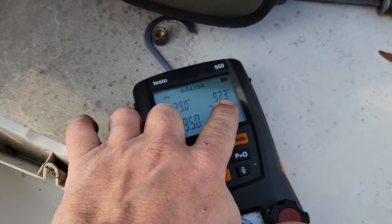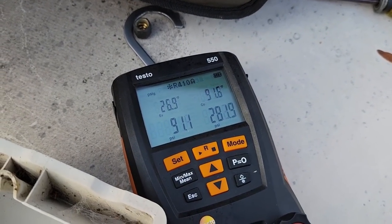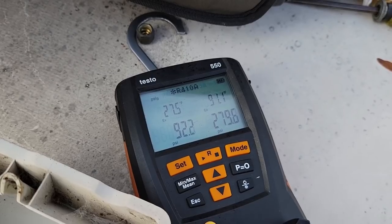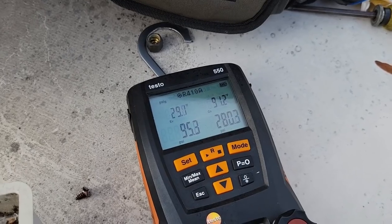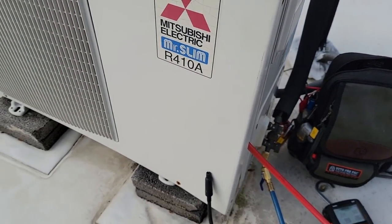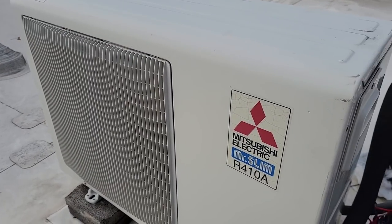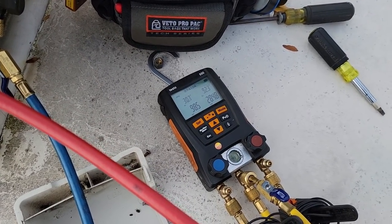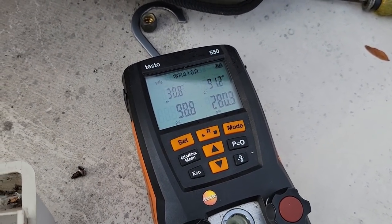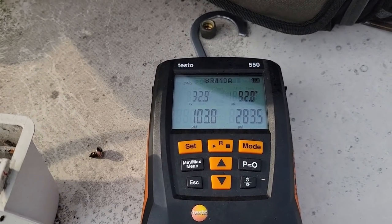You can see our condensing temperature is at 92°F, slowly building up. The fan is finally starting to kick on like it should. Generally this thing is set up to hold around 100 degree liquid temperature. I'm tapped onto the high side right off the discharge — it's the only place to get it. This is primarily just a regular generic cheap air conditioner — not a variable speed compressor, not even a TXV system. It's literally an orifice system. It's been running for about eight to ten minutes. We're holding pretty good right at 92 degrees discharge, 32 to 33 on our suction.